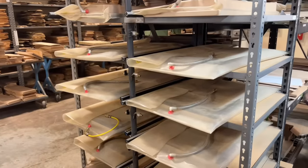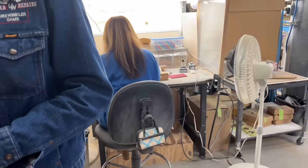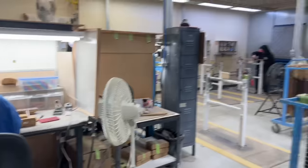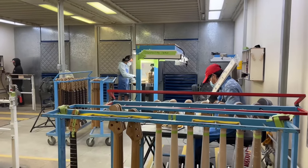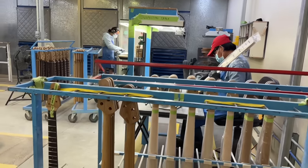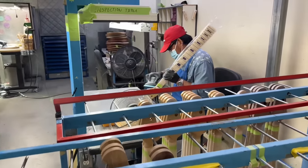Get all the air out and vacuum back it on in. Next stop will be the sanding department. After the bodies and necks are milled, they come in here and there are stations for various processes — sanding, shaping. We also fill in under the fret tang here. Any voids that are there are taken care of here.